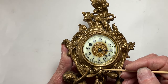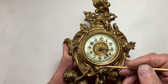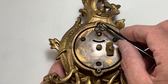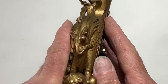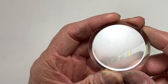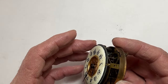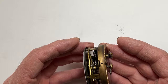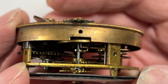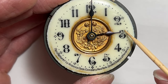Here you can see the dial numbers aren't actually positioned in centered alignment with the case, and one of the mounting fasteners is missing. The crystal is in excellent shape with a nice gold gilt bezel. The customer says it runs for a short time then stops. The balance wheel is bent. The hands are blued, and the hour hand has been installed slightly off.